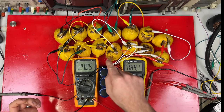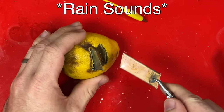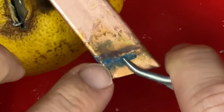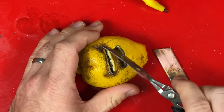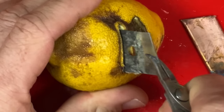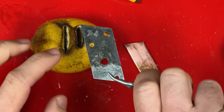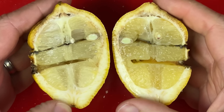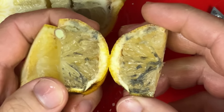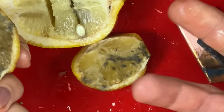Let's see what the Gameboy can do with the power extracted from 14 lemons. But first I want to do a lemon autopsy. Wow, the copper is actually shinier — it's improved. It's got some pretty blue oxide up the top too. The zinc is pretty much all gone. I think this is the one that was making the charge increase when I wiggled it, because there's hardly any zinc left — it was just cleaning off the dirt to make better contact with what's left. Surprisingly it doesn't look too bad inside. I thought it would go all black. But it just looks like lemon. It's a bit dirty on the zinc side, but mostly I think it just dried out and the zinc went bad — and that's why it stopped charging.